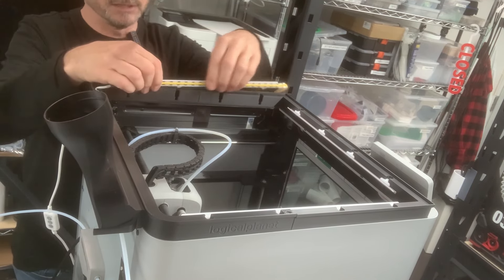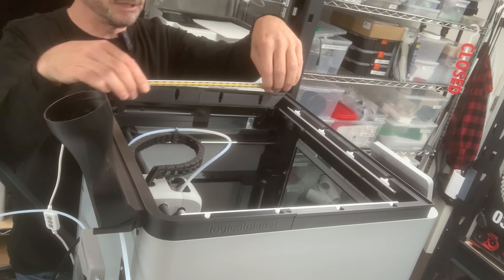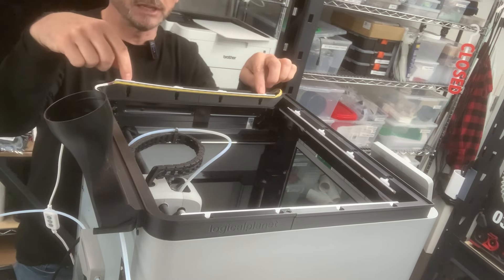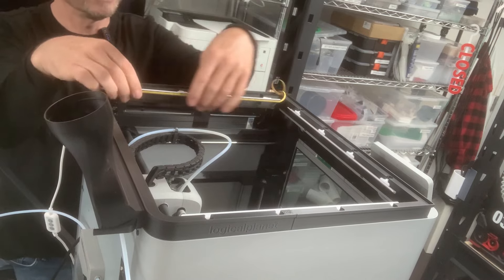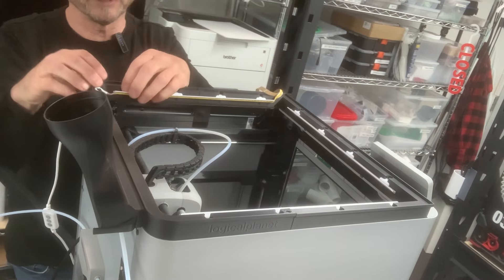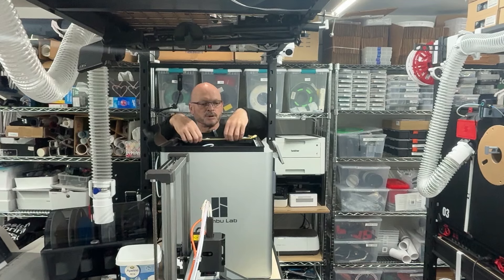On my Vorons I did have a little trouble with the adhesive, so I'm aware that might happen. To help address that, in these slots where the notches are I put a tiny slot so we can put in a small zip tie if needed. That will create a little support for the adhesive so it's less likely to separate from the printed part.